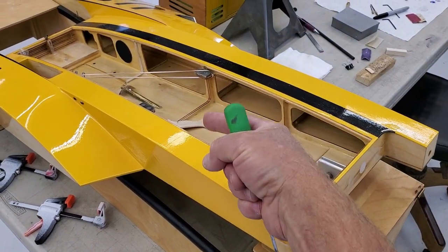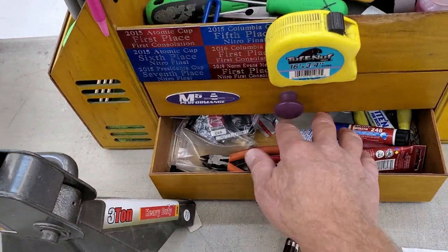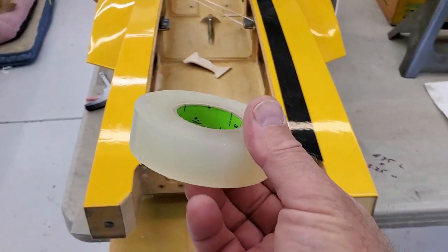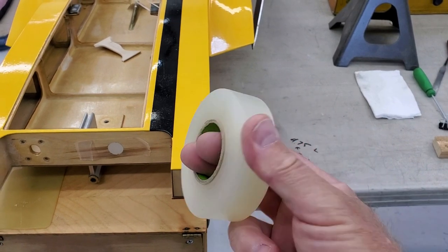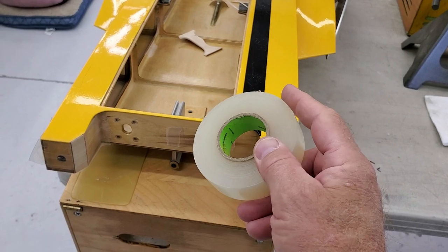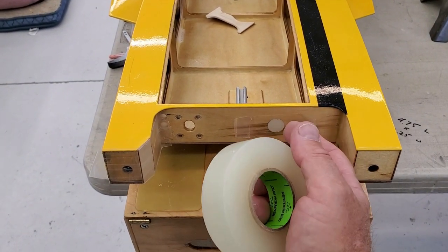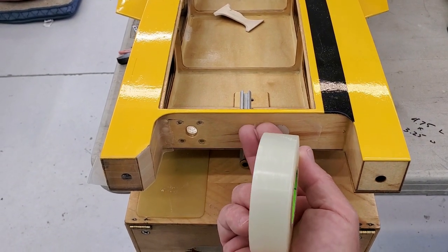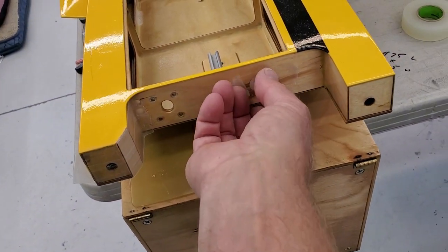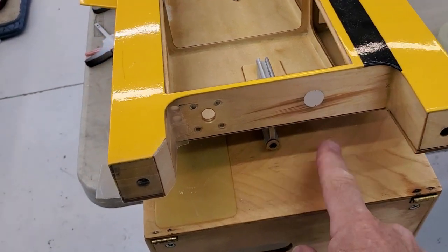Here's what's happening on the boat. Last night, I taped over the rear here — I use hockey tape. Pretty handy stuff. It's kind of stretchy, a little bit like electrical tape, only it leaves no residue, even on epoxy. I taped it over with the hockey tape, left one edge to fold over on the tape — that helps, makes it easier to get a hold of it — then stood the boat up on end and filled the old exhaust outlet with epoxy. Used West Systems here; I put in a ton of micro-light filler so it would be really light, and added a little bit of brown to it too.